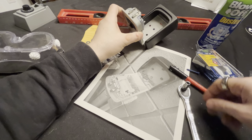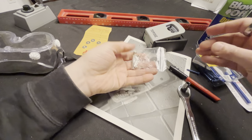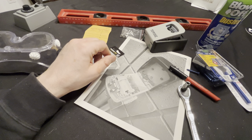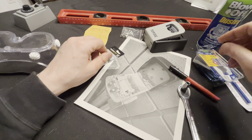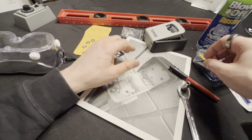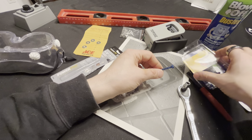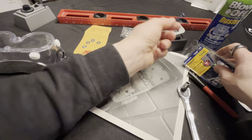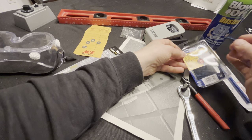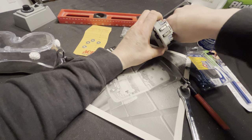This comes with some screws and some anchors. I'm pretty sure these are from the master, and I think there were plastic anchors as well. But my research indicated that plastic anchors aren't actually the best. You can go with different fasteners for brick or concrete, but the best middle-of-the-road option seemed to be Tapcons — this particular version is called Tapcon Plus. They come in different sizes, so this is the size that worked best with the holes I had to work with. I didn't use the included anchors — those are set aside.